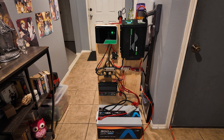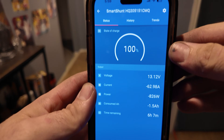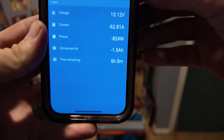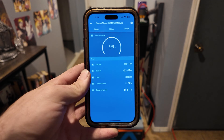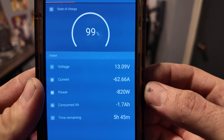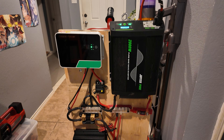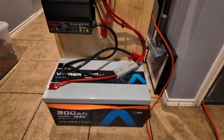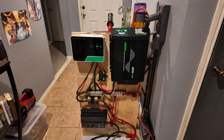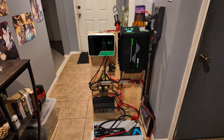Keep in mind this is only on one 12-volt 300 amp-hour battery. Right now it is 5:59, we're at 100% state of charge, and the counter says it should last almost six hours. The amperage has stabilized — pulling 820 watts, already at 62 amps on the DC side. Personally, for 12-volt systems I don't like to run over a thousand watts, because once you exceed that you're pulling 80 to 90 amps. At that point you really need excellent connections and wiring, and it's generally better to move to a higher-voltage system to lower the amperage.